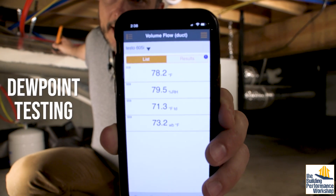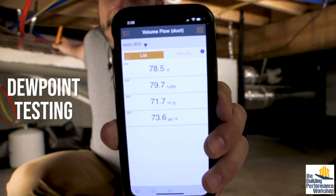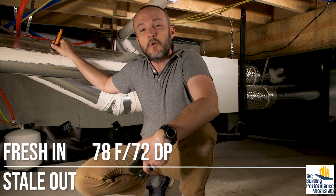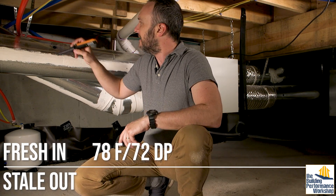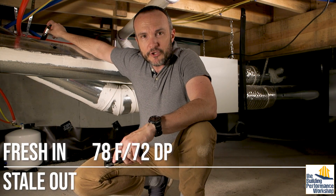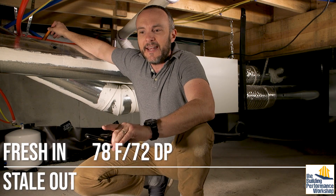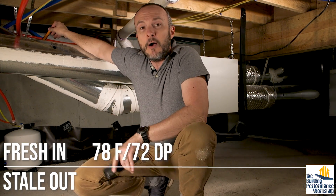As you can see, we have 78°F air coming in, but it's 80% relative humidity, which makes the dew point of the incoming air about 72°F. That is somewhat dangerous because inside a home you may have surfaces at 72°F if you run the air conditioning pretty seriously. Dew point is the metric that's most important here — it indicates the interaction between air temperature, humidity, and surface temperature, giving you a clue about when things are going to get wet. That's the most important thing to be able to predict and prevent.